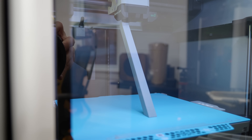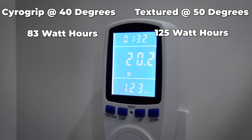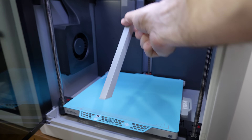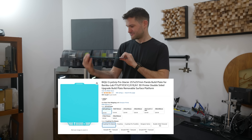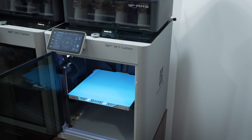I wasn't expecting to see that big of a jump, but according to my power meter, lowering the bed temperature by 10 degrees reduced overall power consumption by almost 50%, which is kind of insane. So for the price, I actually like this CoolTac plate, and it might just become my default build plate.